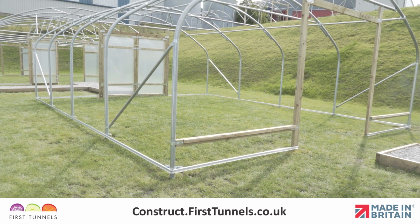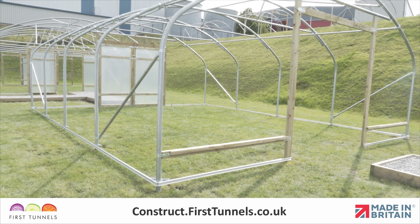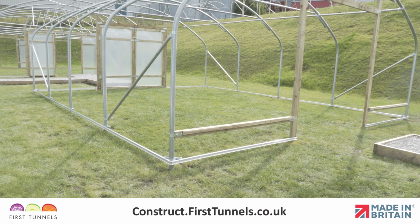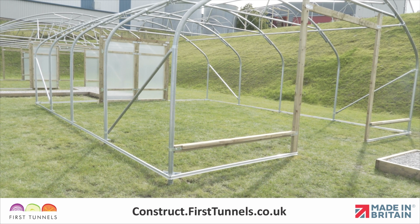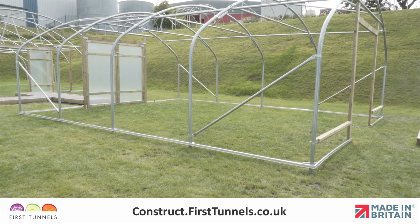If your ground is not on a slope, then repeat the procedure you followed for the first half. If you have a slope across the width, fitting the rail on this joint will create an unnecessary gap. We advise setting the base rail at a height that eliminates the gap as much as possible, but still ensuring that the rail from the doorpost to the corner hoop is level. Ensure that the rail is at a consistent height. A string line will be handy here.